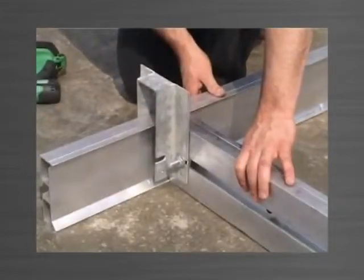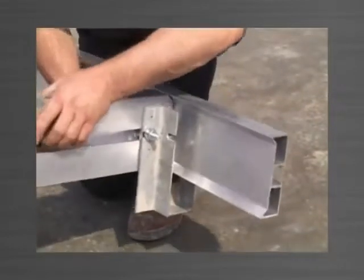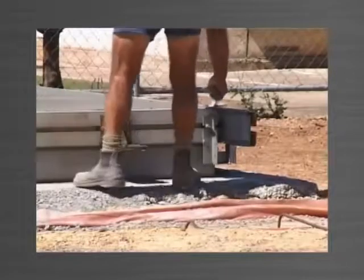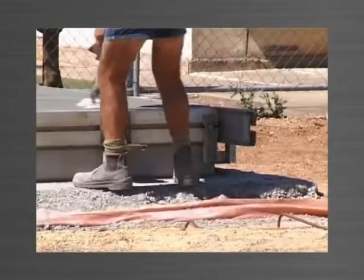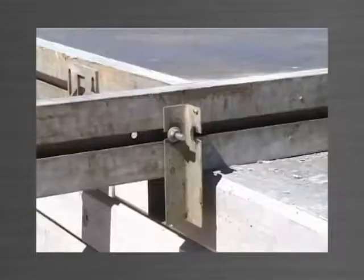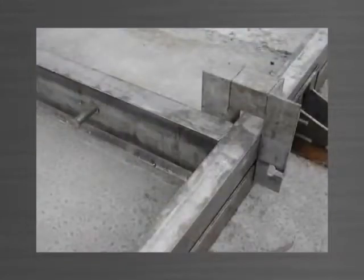After the first panel is cast, the corner bracket can be mounted from the underside to eliminate any obstruction. The corner bracket is adaptable to be used for left and right hand corners from above and below, and as with every Panelware bracket, for all four sizes of edge form.